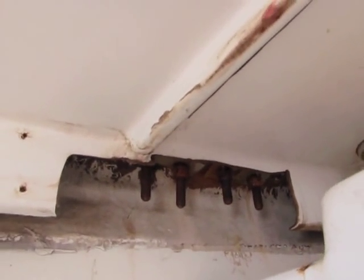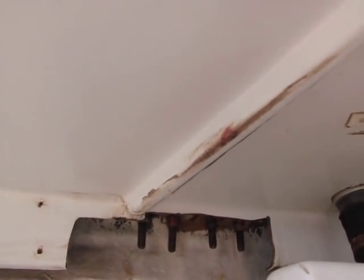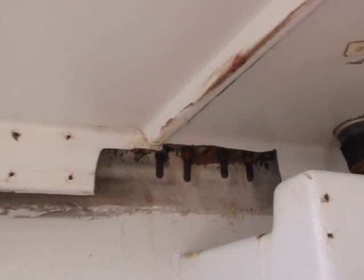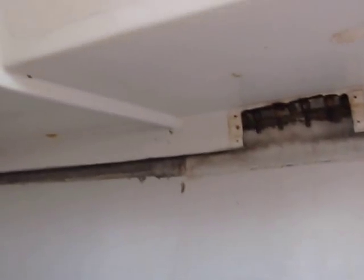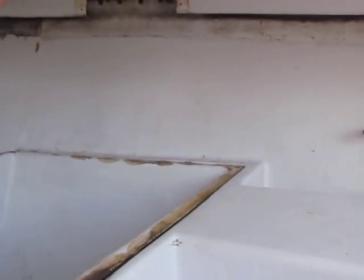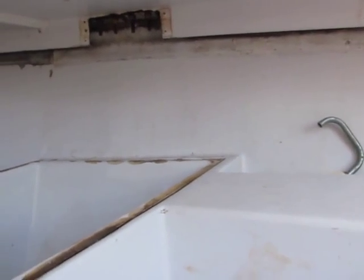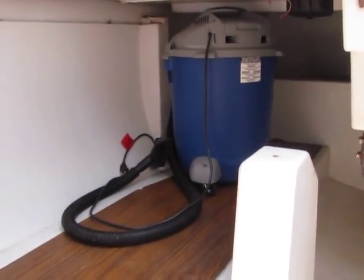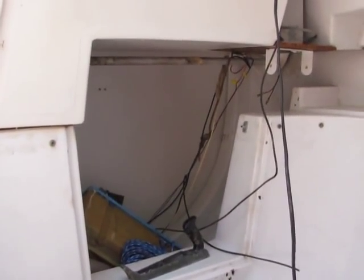That's going to break. If you're going out to the Bahamas or anything, you get a hellacious storm, it's just going to rip the plates right out. Same thing with here. That's why I'm going to make the bathroom bigger and put the wood right here and then connect the chain plates to it. But like I said, the galley's going to slide underneath here. I'm going to have a nav station right here.